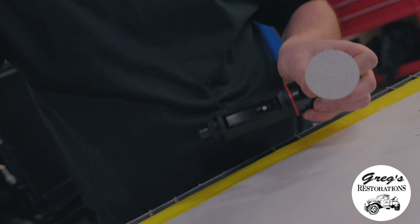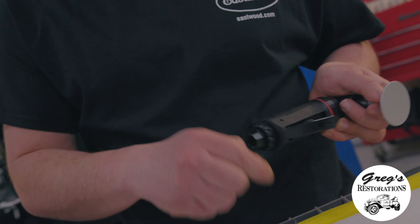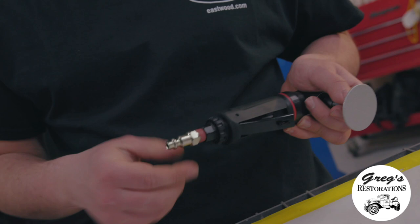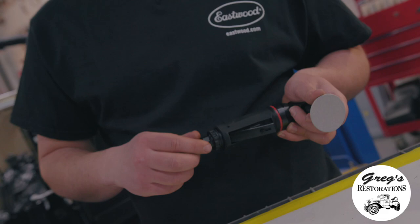It also comes with its own air fitting supplied with the kit, versus other brands where you have to buy it separately. It's actually ahead of the game already, and it comes with thread sealant on it, ready to go. For our sake, we're not going to be using this fitting — it does not go with our airlines installed in the shop, so we've got our own bubbled flare end that we're going to be using with it.